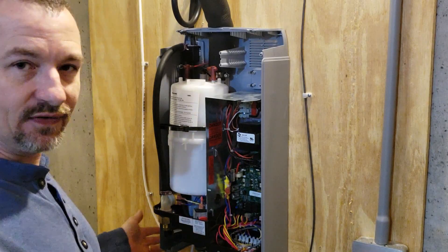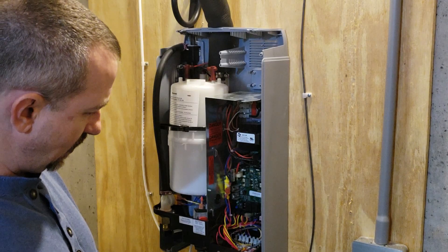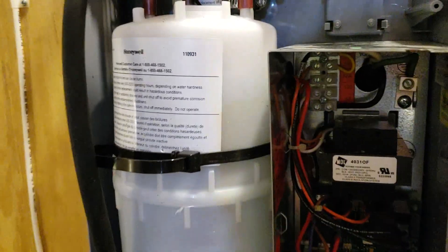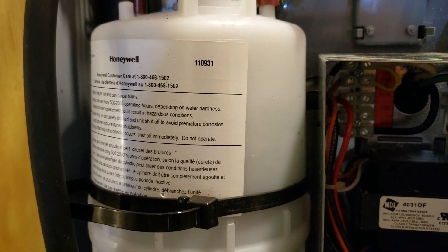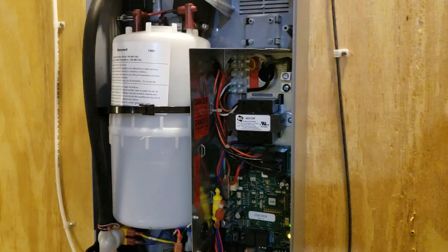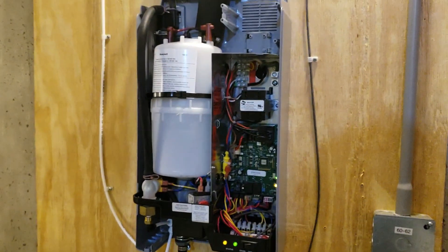Power's back on and I've turned the water back on, so we're just going to hit the on button. If you listen carefully you can hear it, and you can see the boiling going on inside the tank — it looks like it's working great, no leaks. I'll put the cover back on and be done with it. Thanks for watching — pretty simple one on changing the tank in this electro steam humidifier. Hope you enjoyed it and find it useful. If you like it, subscribe to my channel and I'll see you next time.